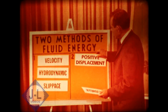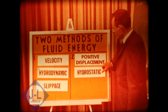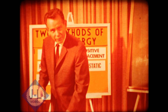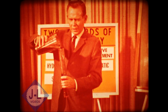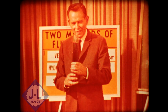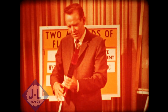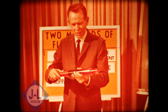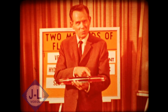The other method is the positive displacement approach. This is the method used in the hydrostatic transmission. This approach has some very significant advantages. The simplest, most positive way to displace the fluid is with a cylinder and piston, as in a piston-type pump. If we add a second piston to the system to react to the first, we have, in effect, a pump and a motor. Notice that the very same components serve as a pump when exerting pressure and as a motor when reacting to it.